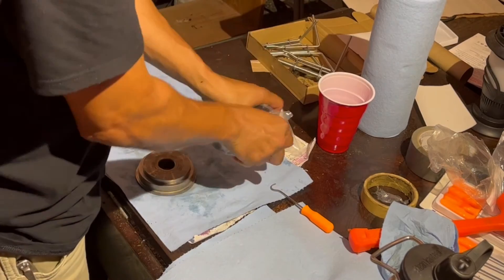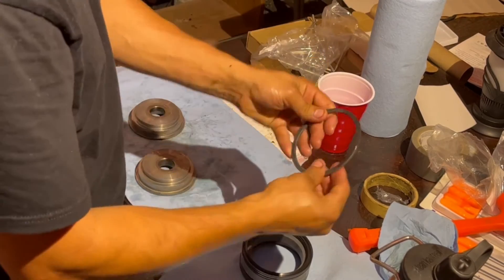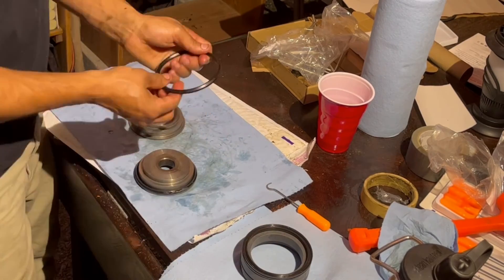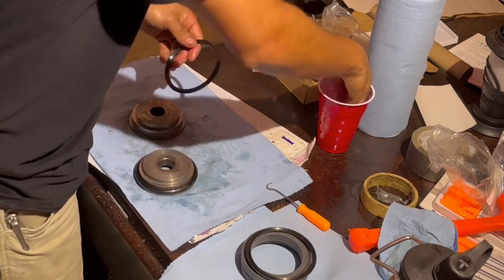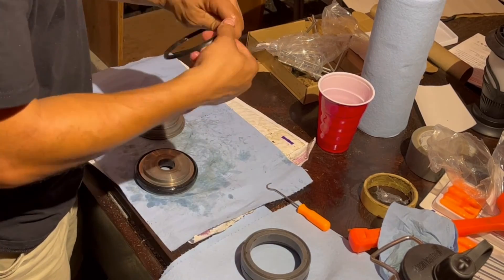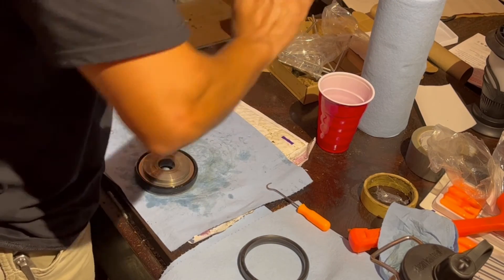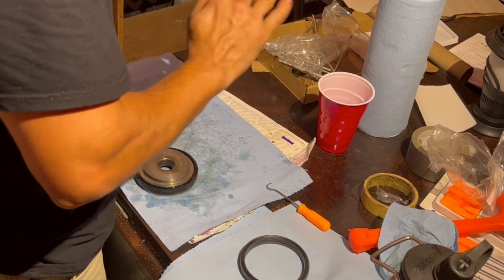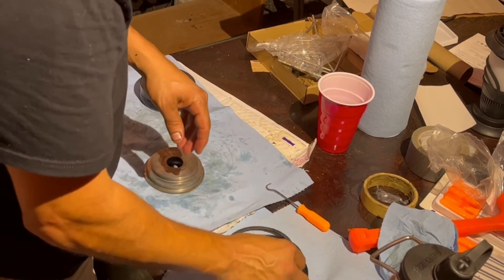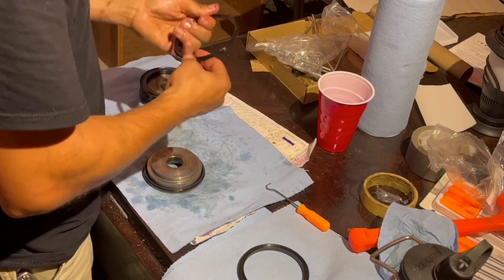Next I'm going to be showing you the easiest part of this job — it's replacing the packing on the piston. You open up the bag and it is already pre-assembled. All you have to do is pull each one of these seals off one by one, coat them in hydraulic fluid, and place them on top of the flange on the piston. These are chevron style seals and they snap into place one over the other.